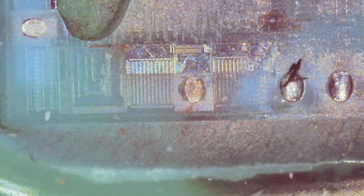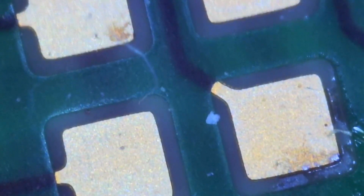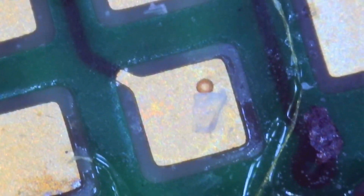This isn't like 7 nanometer or anything like that — probably like 20 to 100 nanometer, probably less. There's a gate — sorry, a via right next to it. It's actually quite a small via too. And there's not much definition there because it looks like that's where it connects. Here's the pads. That's the little SMD resistor next to it — actually it's a diode. But we've got the copper pads next to it. They almost look gold plated because they're quite beautiful.